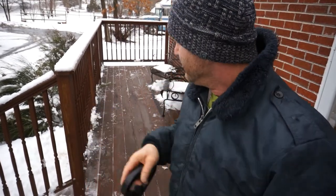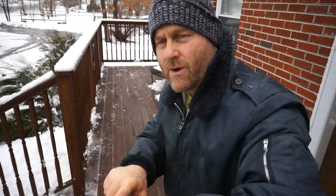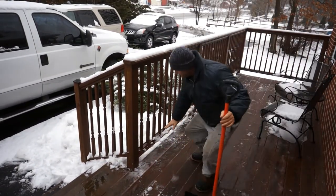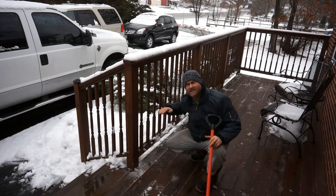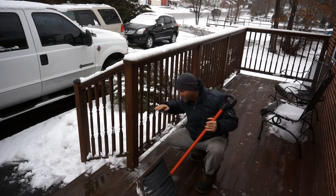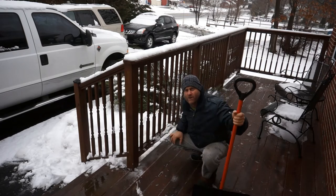When you're making that deck and going back and forth on what height for that railing — do you want it to touch the ground, do you want your pickets to come up off of there — I would say no. If you're in a hot environment, go for it; you don't have snow, salt, or anything to scrape off. But if you're in a wintry environment — we're in Maryland, if you're further north, Connecticut, New York, upstate New York — you definitely want to make that bottom part of the railing at least six inches, and I'd say that's the minimum. If you're getting heavy snow and need to get under it, you'll have to scrape the top layer. But if you stay up on it and don't let it get to 15, 18, 20 inches, you can get it under there, it'll melt out, and it makes quick work cleaning off that deck. Make that bottom railing at least six to eight inches.